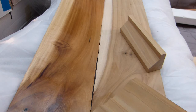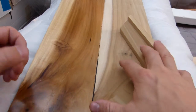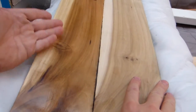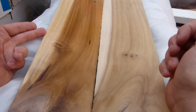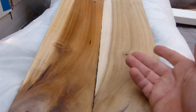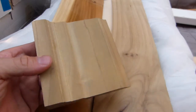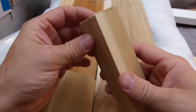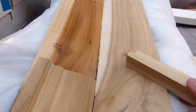This poplar is fairly easy to identify. The sapwood is sharply different from the heartwood. Whether varnished or just sanded, you can see the sapwood is creamy white and the heartwood has a brown or cardboard-brown color, but there's also a bunch of green or olive green in it, especially visible on the sanded sample. Same on this trim — it's got a sliver of sapwood and the rest is heartwood with this green discoloration.